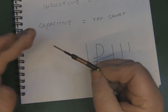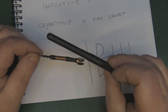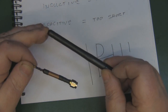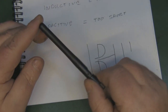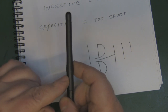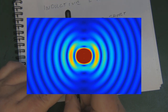You find it everywhere. Even if you buy an FPV card at 2.4 gigahertz, you normally find that you get a cheap little dipole antenna given to you with that. I mean, you tend to upgrade this as soon as possible, but if you pop this open, you will find that it measures 25 millimeters by 25 millimeters. And radiation pattern is the reason why these are so popular and the most common antenna used at these frequencies, because it gives out that nice donut shaped omnidirectional radiation pattern that gives a nice even distribution in all directions.